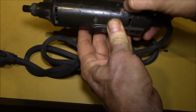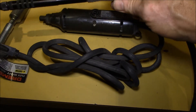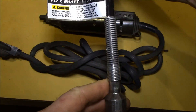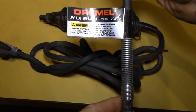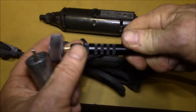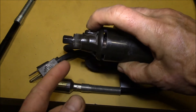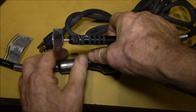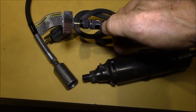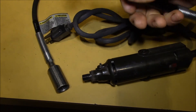This is the old style — just on/off, no speed control. Then probably about 30 years ago I got this original flex shaft. It's not the newer model — this is the old original Dremel flex shaft, Model 225. I know it's the older model because it doesn't have the push button up here to lock the chuck. So what you have to do with this one — it's a little hard to use — you've got to lock the chuck back at the tool. You lock the chuck and then turn this here, so it's a little inconvenient. But apparently that new chuck locking pin is a cause of problems on the newer model, so I actually think the older model is much more reliable.